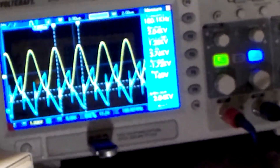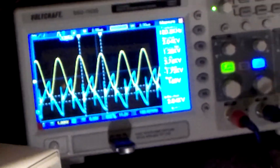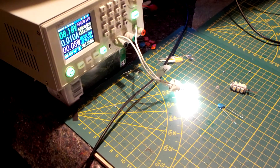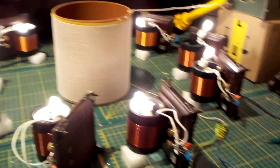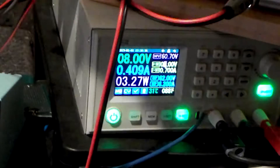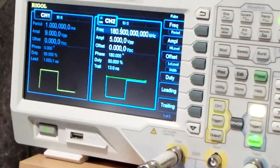As you can see I am still around 2.0 kilovolts. Without the loads it was 2.4 kilovolts. Now the 9 LEDs are at the brightness of that one connected to a power supply, just to see how much power I'm using. So for that brightness I'm only using 0.08 watts per LED, so times 9 it's almost 0.8 watts. If you look at the power supply we can see that I'm using approximately 3.7 watts and the frequency is 180.9 kilohertz.